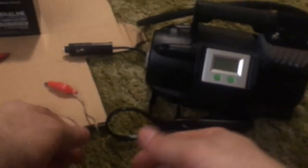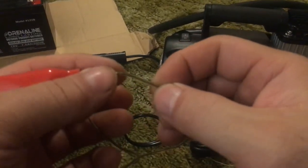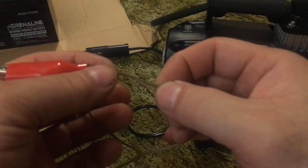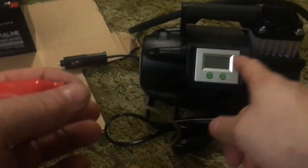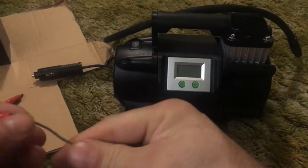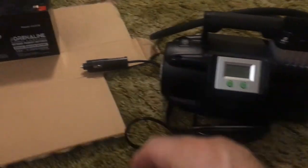And to note, I don't have an amperage measure on here, but I don't believe these wires can handle 15 amps. This is 22 gauge. I mean, I could be wrong. I'll look it up. I think this is 22 gauge wire. It might even be 24. I'm pretty sure it can't handle 15 amps. And me making it sit at the 28, that should have been drawing some current. You know what I'm saying? A little bit of current.